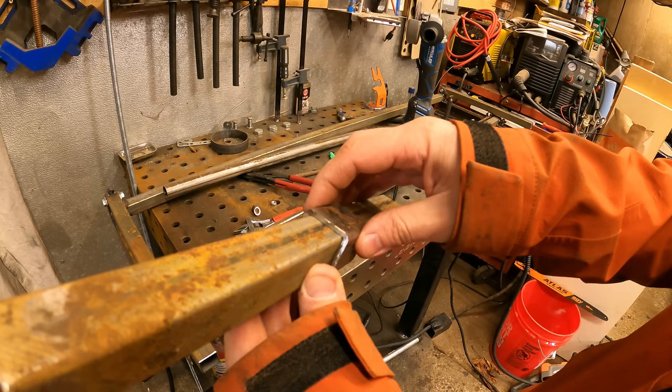I've never milled lap siding before, so right now I'm actually just testing out the jig and locking it onto my mill. I want to check out the prototype. I have everything welded out solid at this point — I was pretty happy with the design, but before I put any paint on it, I wanted to put a little junky cant in, something I can just cut into to see how it works and if I need to make any changes before I have to actually paint it. So I'm locking down the cant right now.